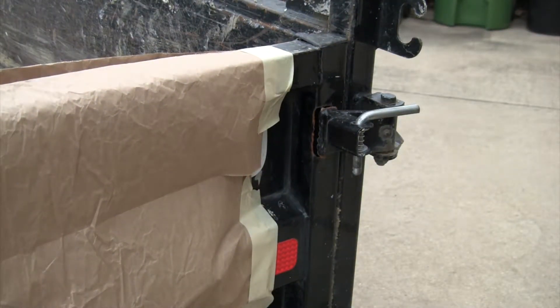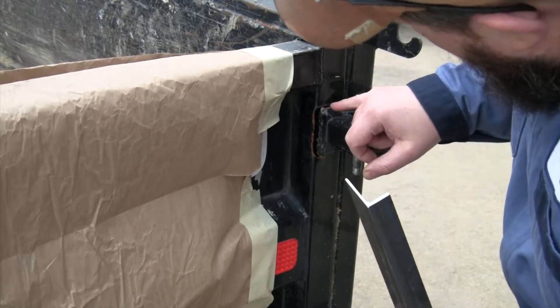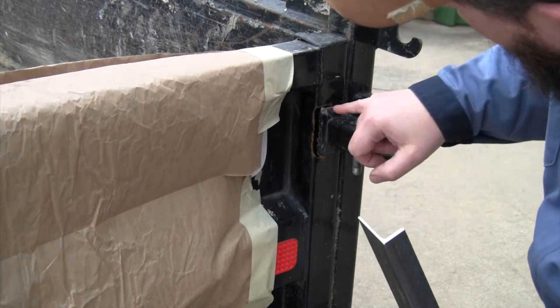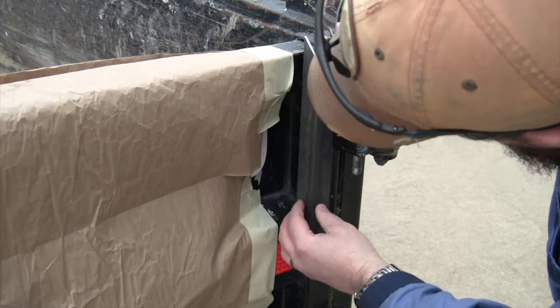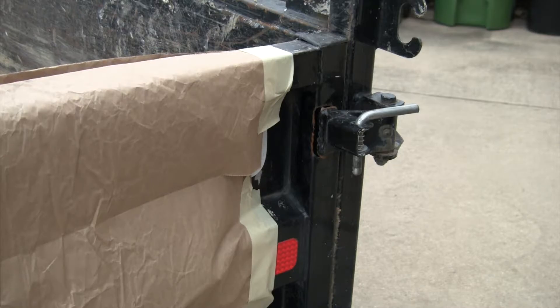I talked to the customer and we can get away with some cosmetic changes. The plan is to take this piece of angle iron, notch it out around that, push that back into place, and then weld a piece of angle iron all around here to get some additional surface area and give a little bit more surface to weld our hinge back onto. He's already welded the top one and had it repaired once, and it's looking like it's cracking out again. Getting some extra material in there will help considerably. Let's get a wire brush on, start cleaning off some paint, get our chunk of angle iron cut to shape, and we'll start welding this back into place.